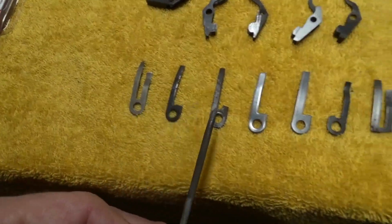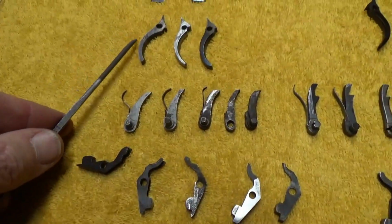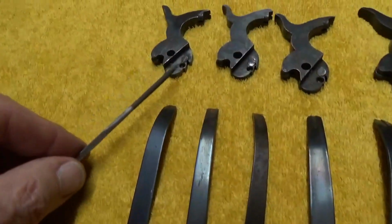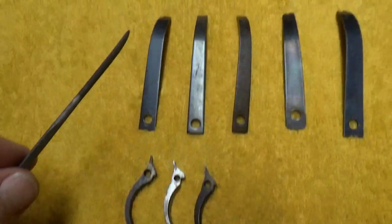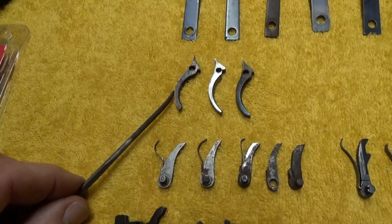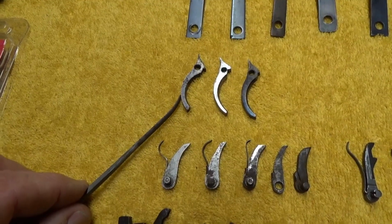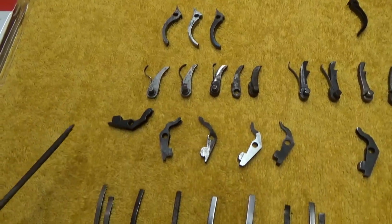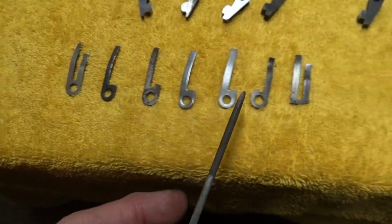If the left hand side goes like it did over here, then we're not going to keep pressure of the trigger against the hammer here, and it will not lock up or stay locked very easily into this position here. I mean, it might get locked in there at some point, but it's going to be just kind of a random thing. You can check that out if you put pressure on your trigger the opposite way you would pull it. Put pressure this way, keep some pressure on it, and then cock your gun, and if the hammer locks up with that process, then you can figure that it was the trigger side of the bolt spring that broke off, like the case over here.